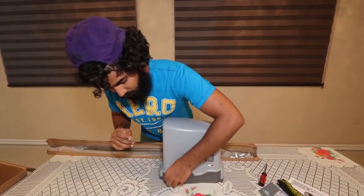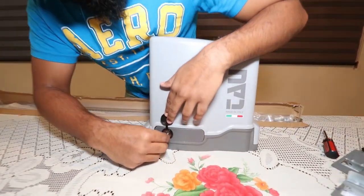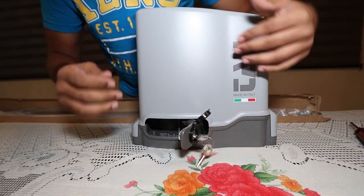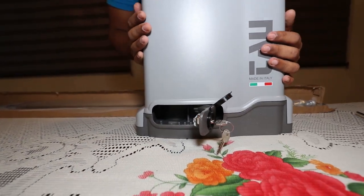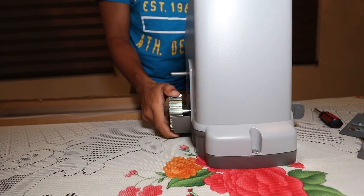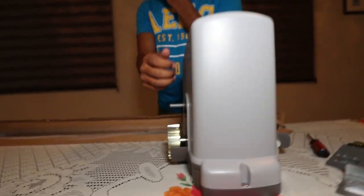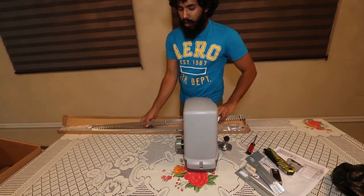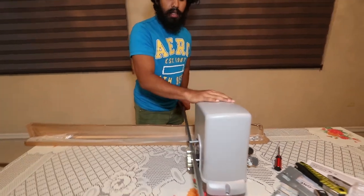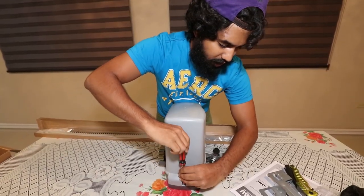To open the lock, use the keys that it comes with — insert it, open it, and pull it open. Now when it's pulled open your gate will be able to function manually. As you can see, you can now turn this gear by hand, or the gate can be pulled. The track slides along nicely.